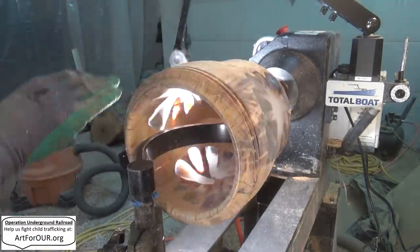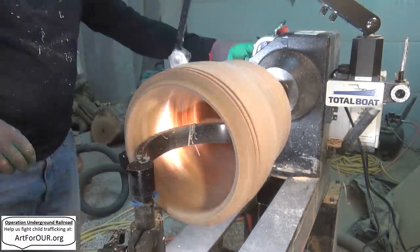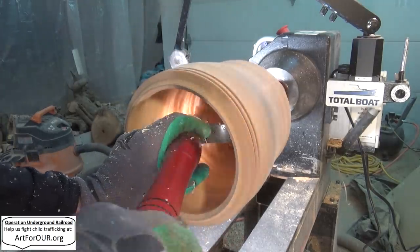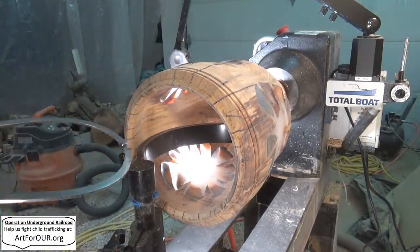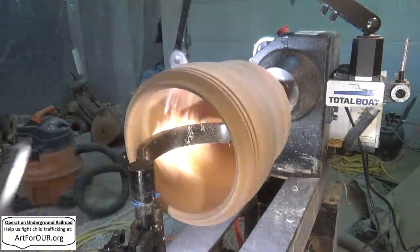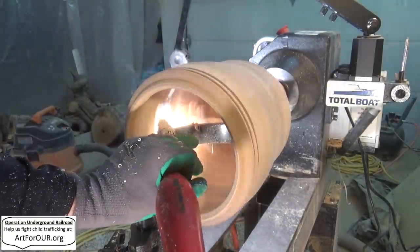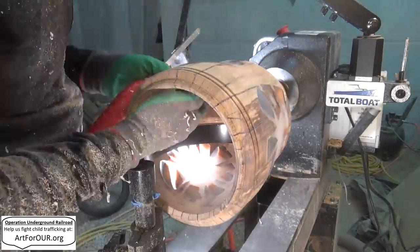Then when you turn around and put it in the pressure pot, which I've got there, which is a 5-gallon pressure pot, it compresses it. So any subsequent bubbles that showed up get compressed and, you know, just kind of cleans it up for you, and it's crystal clear. It's fantastic. If you're going for a clear resin look, I don't think you can beat that process. It's phenomenal. For what I've got to work with, for who my sponsors are, I am really happy with what we've got. I've solved all the problems of bubbles in my resin.